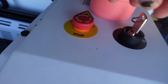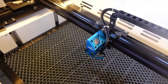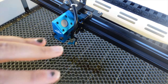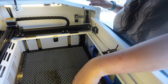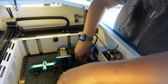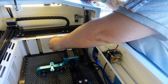Since we're going to put in the rotary, the first thing we need to do is turn on the laser, and then the laser is going to want to do its little starting program. Hit confirm and move. Mine was already in the corner so it really didn't move much. That traveling is just going back to the last place where I hit the origin, so keep that in mind if you have something in the bed — like if you'd already put your rotary tumbler in there. It's going to go back to the last origin if you've chosen user origin in Lightburn. I'm going to move the laser head all the way back into the corner, and then put the bed all the way down. The motor goes towards the right side of the laser, and I like to butt it up against the ruler on the right. Then I'll shove the excess cord over here in the front, and plug it in to where it says rotary.